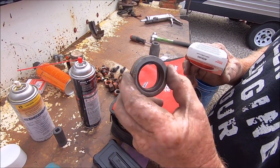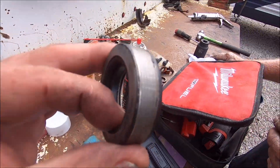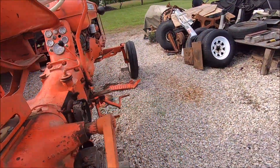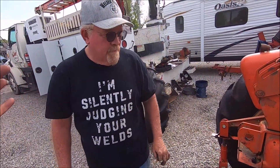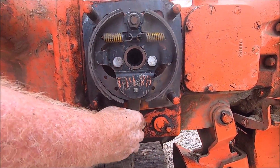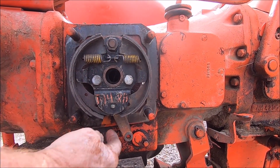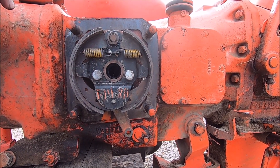These were like original 1958 stuff. Both of my brakes were just soaked in gear oil - that's why they weren't working. They worked enough to get it unloaded off the trailer if you stand on them hard enough. It's all pretty straightforward. If master mechanic, wrenching wizard dad can figure it out, most of you all can too. We figured we'd just do a little video on it - if anybody's got any questions they can ask. There's a couple other videos out there but nothing specifically on a D14. The D14 is about the only one that's got this style - almost like a truck. Most of them have an external clamp, like a band or a brake drum on both sides with a pin you've got to burn out, but that ain't anything like a D14.